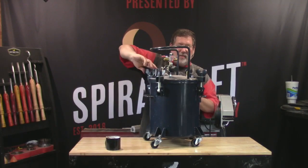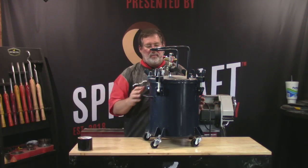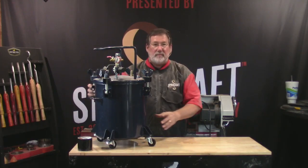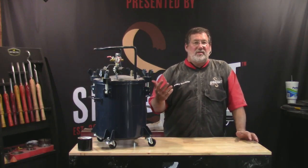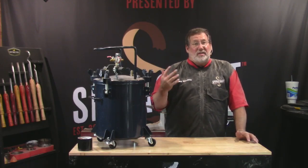But that's not going anywhere. I don't have to worry about the time with the setup or anything like that because it's got plenty of time. So I'll take the air hose to it, put 70 pounds in it. She'll be ready to go. It'll start to cure in about 3 hours. That resin will start to kick for that amount of mass. It'll be cured in 24 hours. I'll take it out tomorrow.